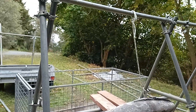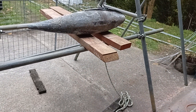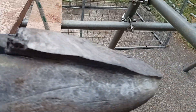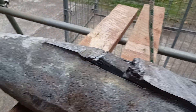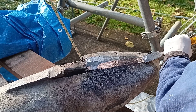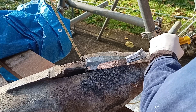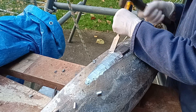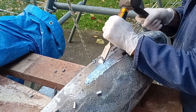I made this scaffold yesterday to be able to lift the 240 kg lead and put it up on a platform where I can work on it. There's certainly a bit of work required — I've got to maybe chisel off this part here and get it fair. Thanks for watching. There will probably be a part two to the manufacture of the dagger board and bulb and its assembly. I've already undercoated the dagger board, which was a necessity because the next video will be on the construction of the casing that'll be glassed into the boat to support the dagger board. See you next time.